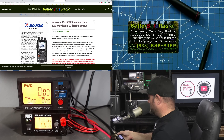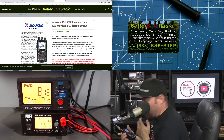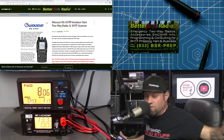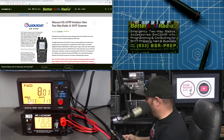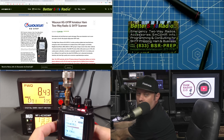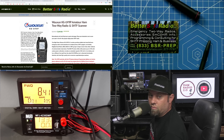On high power, two meters first: 8.2 watts on high power. KC5HWB testing — I'm hearing myself on the radio, but I'm going into a dummy load so I'm only transmitting in the shack. Reading 8.8 watts there. Then moving up to 70 centimeter call: 8.3 watts. KC5HWB testing, new radio. Getting 8.4 watts on that one. Probably getting a tiny bit of connector loss, but it's minimal for an HT.